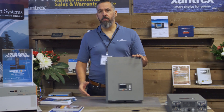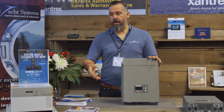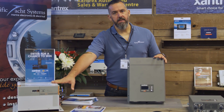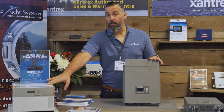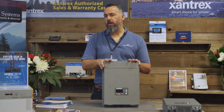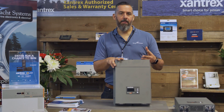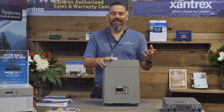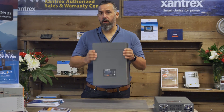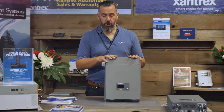If you absolutely need an inverter and your boat is a heavy, continuous user of AC power, then we'll definitely recommend a low frequency inverter — more robust and almost double the price, also a Xantrex inverter charger. But if you want an inverter, don't need one, and you're going to use it intermittently — it's not a must-have item — then this is definitely worth considering. The cost of entry is half of the low frequency inverter charger.